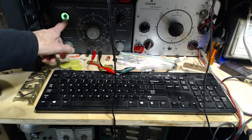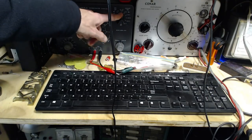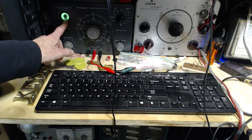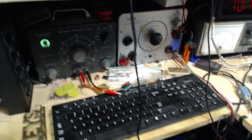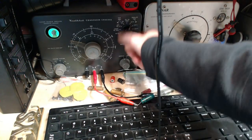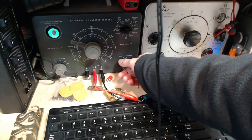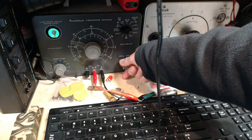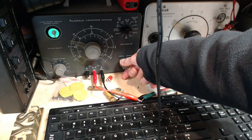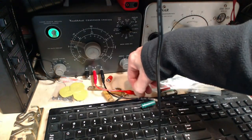You have a good view of the opening of the eye down here. So when I hit it with 25 volts DC, the eye will respond by closing quickly and then opening again. It's how much it opens that matters. My guess is that this is a perfectly fine capacitor. Let's see, here we go. That opened pretty good. 150 volts. Still opening. 250. Well, it didn't quite open on 250. It's rated for 400. A new capacitor tested like this would pop open completely. So there's a bit of a leak in there. That's the tone control one.